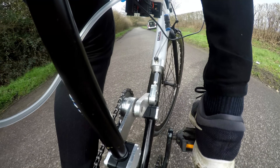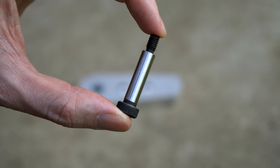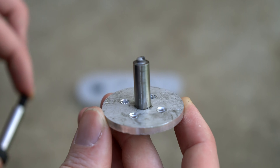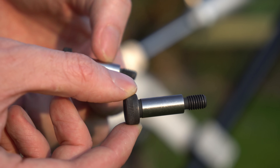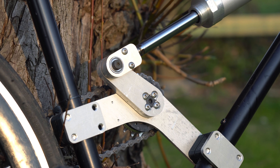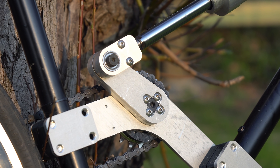For a start, the main crank axle uses an 8 mm diameter shoulder bolt, and the design required the M6 threaded section to be under load, which didn't survive half the rated pressure of the cylinder. I've since swapped this for a 10 mm shoulder bolt, and now the threaded part isn't under load, meaning the diameter of the thinnest section has effectively been doubled and should be able to withstand the full force of the cylinder at 100 psi of pressure.